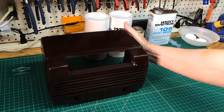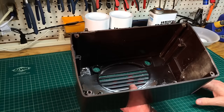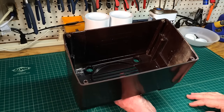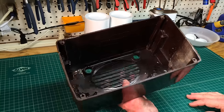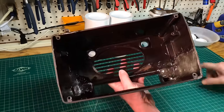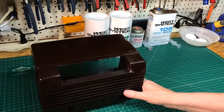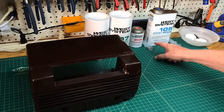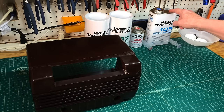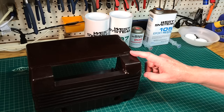Here's the completed cabinet. I've got all the epoxy in with the fiberglass reinforcement, and the epoxy is still setting up — it's still got a ways to go to completely cure. Working with this product was actually simple. First mistake I made was making up too much epoxy — a little goes a long way. I ended up using these syringes here: the red one for the hardener and the blue for the resin. Again, it was five parts to one, so very little hardener is actually needed.